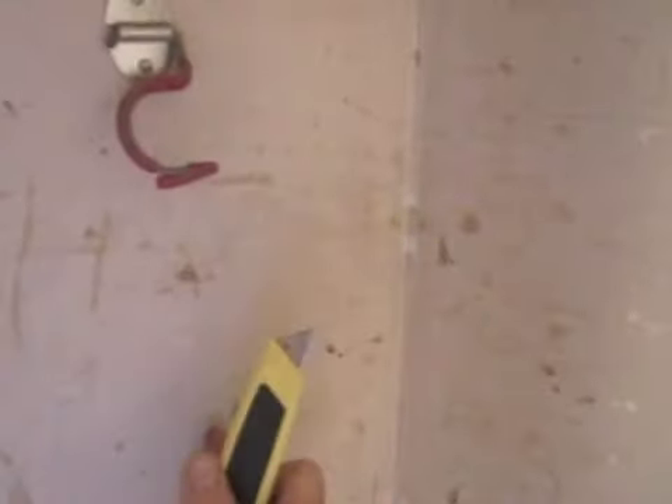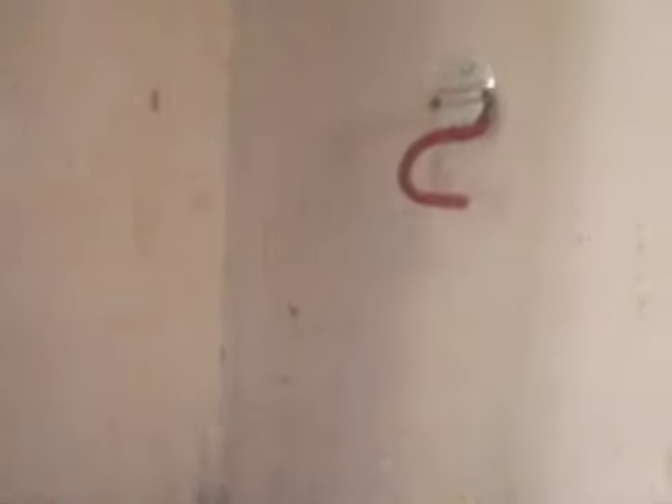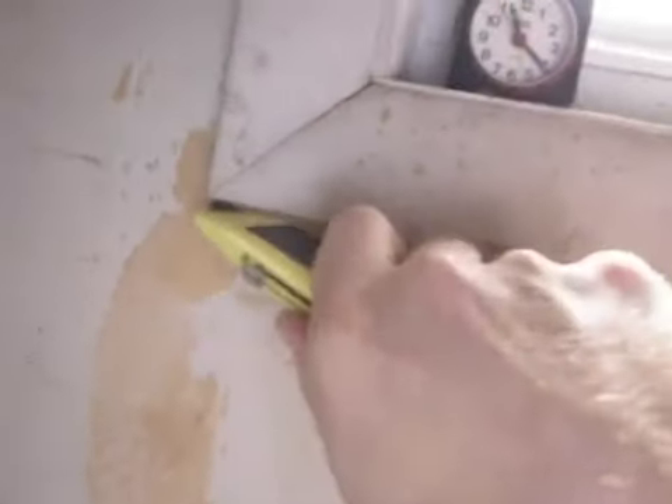You might ask, why do we do this? We want to remove only this wall, not this one. So you cut the edges so that it doesn't do this tearing business. We're going to go along the top, use this tool along the entire top, and down that back wall after we remove the boxes. And here too, we can go along the bottom of the window sill.